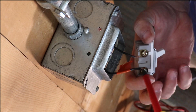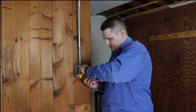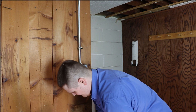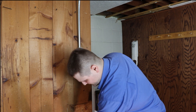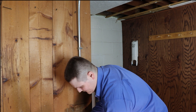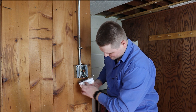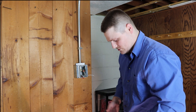I'm going to come here, take these wires apart — one already pulled out because they're not hooked. Get these shifted out here. Here's our neutral — get the tape off of it. Let's get our switch ready and get it out of the box. So back here there's going to be a plate — I didn't lose mine. There's a plate that comes with some screws and you want to make sure you have this. Once it's in the metal box it's not a big deal, but this plate just goes over and keeps these nuts from being accessed or touched — it's just a code thing, so you should put it on there.